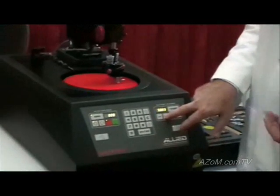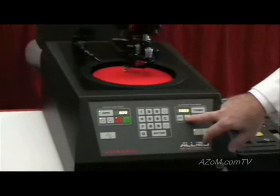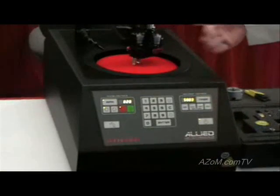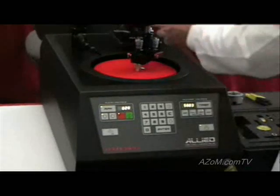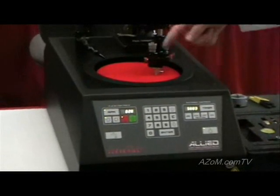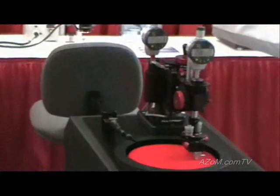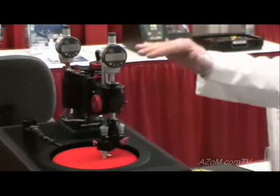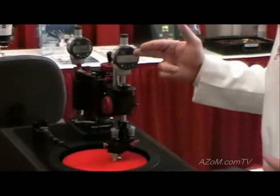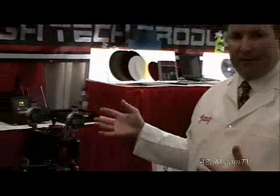There's also a rotation and limit rotation function. Full rotation engages 360-degree rotation of the sample, and limit rotation provides more of a swiveling motion. This can also be utilized as an oscillation motor. Digital indicators on the spindle and at the rear help you determine the vertical position of the sample, while the front indicator tells you the rate of removal — counting upward or downward depending on whether you've selected the positive or negative side of the indicator.